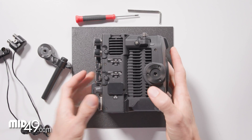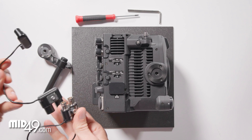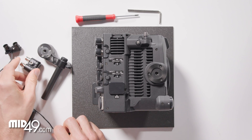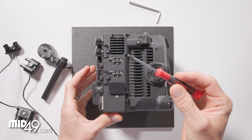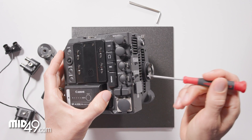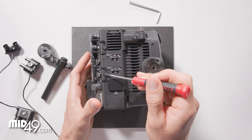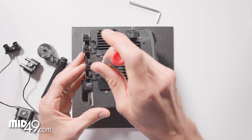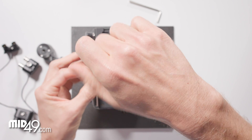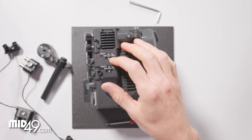In this video we're going to install our AB10 and EB10 breakout boxes onto the C400. To start we'll use a jeweler-style screwdriver — this is optional, but I can't see a way that this would not absolutely drive you crazy if we didn't remove these. We're going to start by removing the screw that holds the cover plate for the mini XLRs. These are just the dust port covers which will dangle for eternity if we don't remove them.